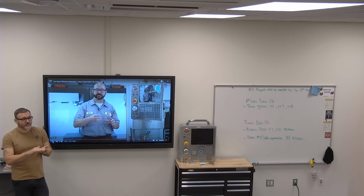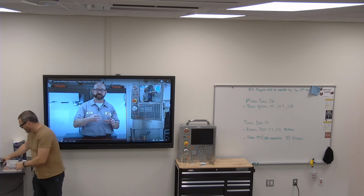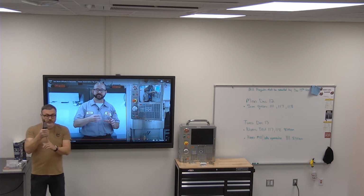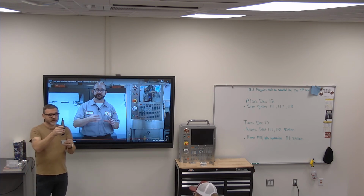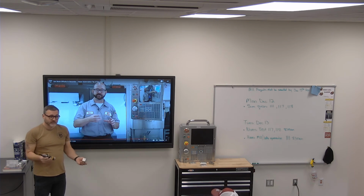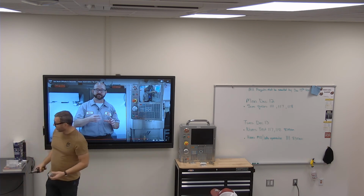But now if you're away from the part, let's just say like he was showing you, the body of the holder was at the edge, but the probe sticking out wasn't, and it hits this area here, it will go continuously until it errors out. It will crush the probe. It won't stop till it hits the probe. Yeah, because it would miss the probe if the probe was sticking out there. Or, let's just say you were doing this part, and you went down through the hole. You keep going till it just doesn't know. So one of those, $5,000 is the probe end. Yeah, just the end of it.